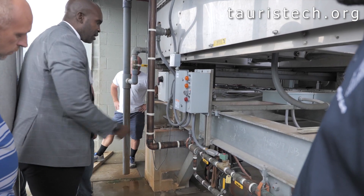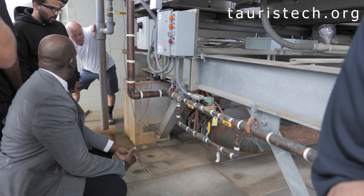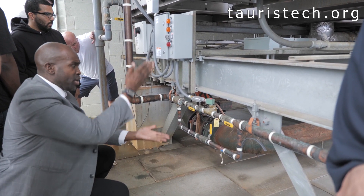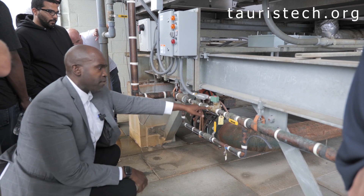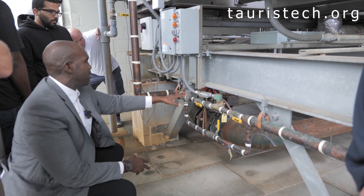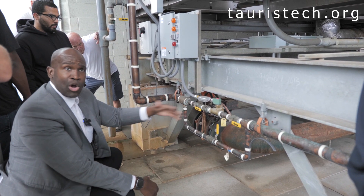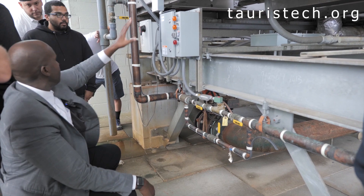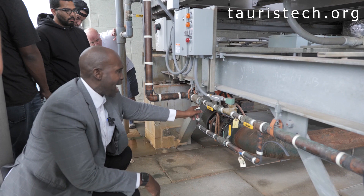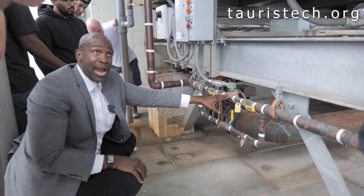So that's a bypass. This right here — we use the word solenoid valve. This is a solenoid valve, and we can open and close the water flow coming through here. It's connected to this control, which is probably connected to some type of BMS, where it's saying you have this much water going into your tower over time — maybe there's something wrong with the tower. These are bypasses: I can open them up to keep the water going in there while I'm repairing that.